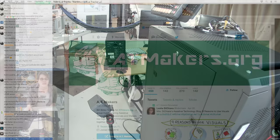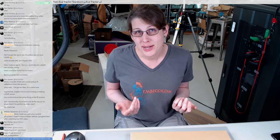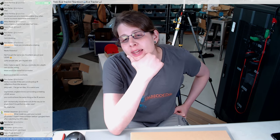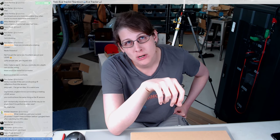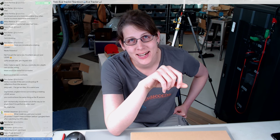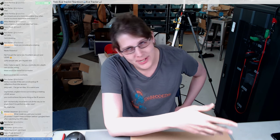So the iX, for example, looks like it might be useful if you're actually building something around a laptop, or not a Raspberry Pi, but something a little bit more powerful, preferably that can run Windows. But maybe with a lot of software work, we could run parts of their Windows software on something that's powerful enough that has a USB 3 host, like an Orange Pi. Not an Orange Pi. I keep getting these various boards mixed up. There's one single board computer that I've seen so far with a USB 3 host, which is one of the Odroids. So that was going to be one of my candidates for getting the iX software running on there, if we were going to try to get their x86 algorithms running through some kind of translator on ARM, or just redo parts of it.